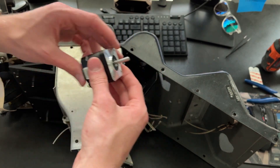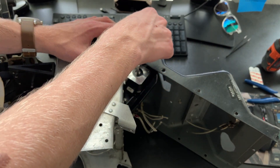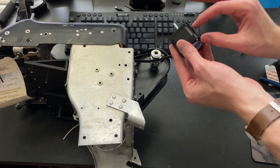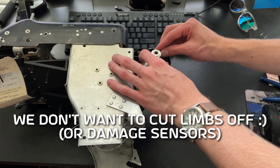What I'm going to do is get a stepper motor like this and put it in here, then loop that into the timing belt so it gets routed from here, up here, and back to the motor. I'll have to drill a little hole and make sure there's clearance for all of the routing. I'm going to get a pancake stepper — they're called pancake steppers because they're thin. They're a lot shorter than your standard stepper motor and also a little bit weaker, which actually works in our advantage. We want a very weak motor that can just barely overpower our trim wheel.